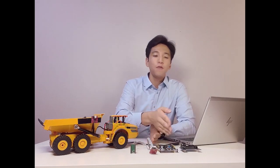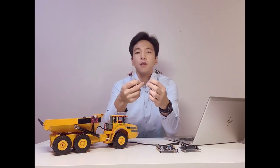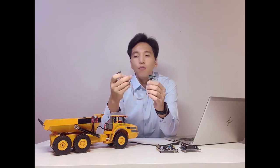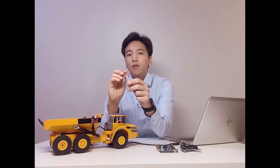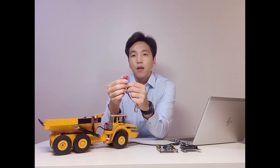To quickly evaluate our latest inclinometer device, I have here three pieces of hardware that you will need in order to connect to our software tool called Unicleo to see sensor results in real-time. The first piece is called the ST-Eval MKI-209V1K. This includes a DIL-24 adapter with a ribbon cable attached on both ends to a small adapter board that has onboard the IIS2ICLX. This also has the ability to mount either by screws or with a double-sided adhesive.